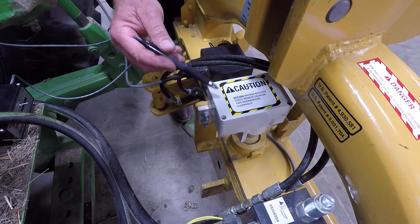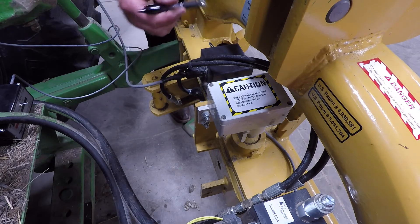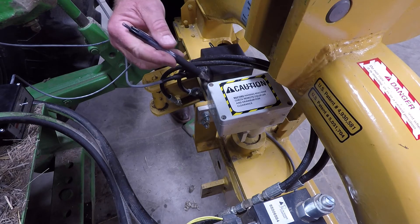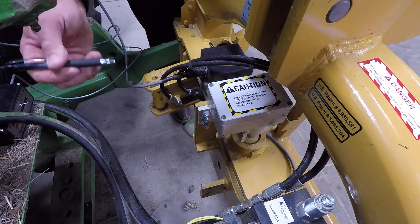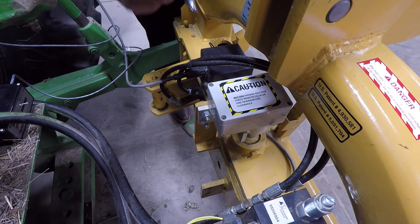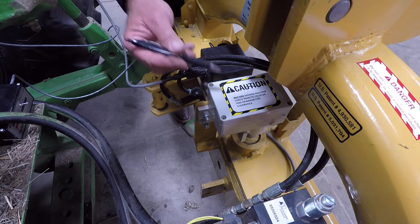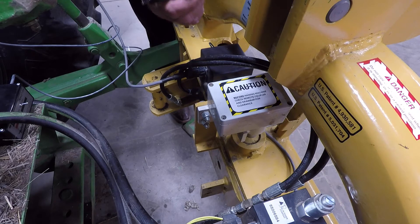The toolbar sensor is mounted directly above the pivot pin of the Scout. It monitors right and left hand movement of the toolbar and Scout. Its purpose is twofold: one, to create a true center line going down through the field, and two, when the mercury switch tells the Scout to center up, this sensor overrides the wand sensor and goes to center, so when the farmer pulls into the crop row again the cultivator and everything is square.